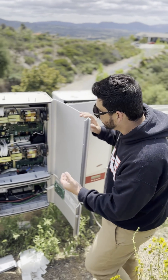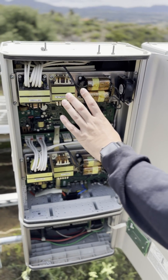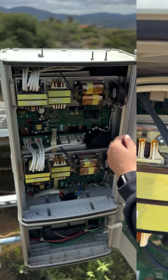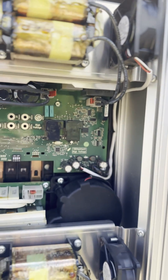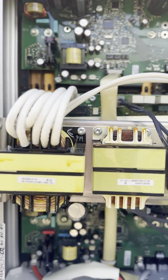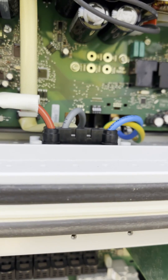If we get in here real close you can see what I'm talking about. There's transformer equipment up here converting DC energy into AC, and if you get in close you can see they're all on push pins. All these main components that are most likely to fail are on push pins so they can be replaced if a failure occurs — and that's something you just don't see anymore.